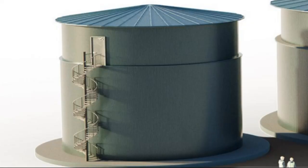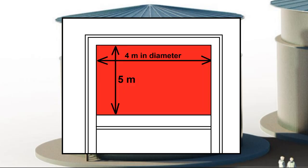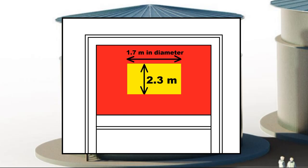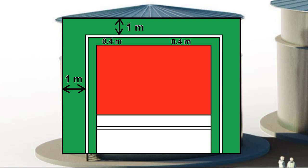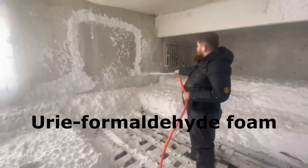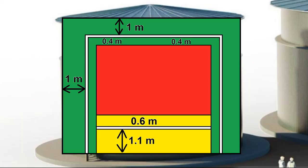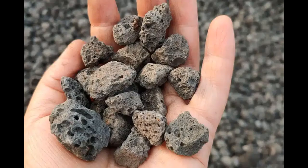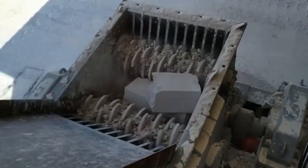Those tens of tons of sand might be placed inside this circular wall with such dimensions, and cheap sand heaters powered by the solar panel electricity are located in this zone. These are two layers of thermal insulation — mineral wool or urea-formaldehyde foam. These are two layers of rigid thermal insulation — expanded clay or granules of blast furnace slag or cheap recycled crushed concrete.